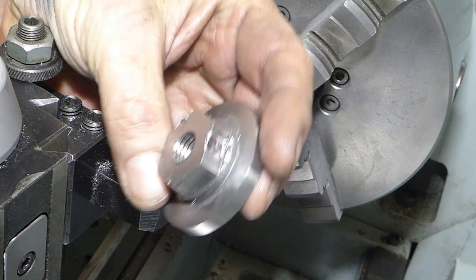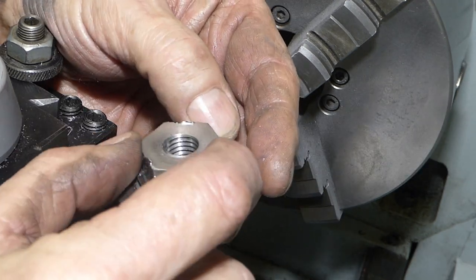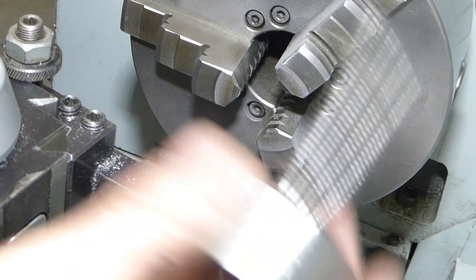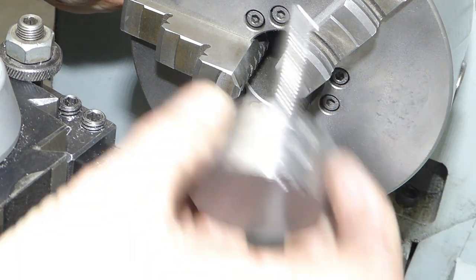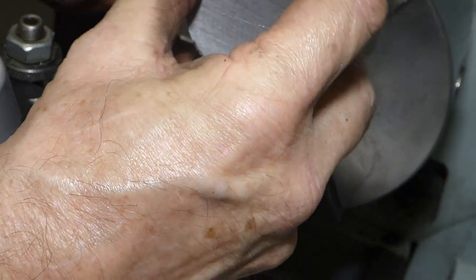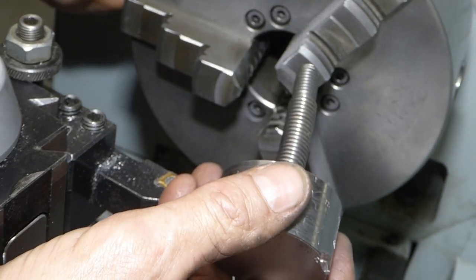The nut, which is where it pulled out of the chuck, I'll just machine that down to a smaller hex that I can save, and I don't have to redo that left hand thread because that's fine. But that part, I think we will make a new one. Just not thinking, eh? If I'd moved it that 10mm into the chuck to machine that off, it wouldn't have unwound because it would have been held by the chuck. Anyways, that's how it goes.